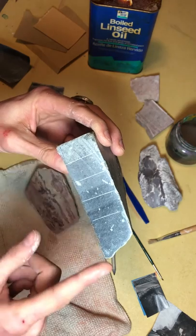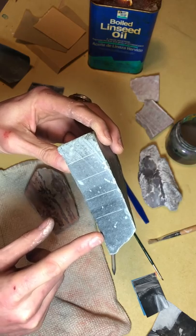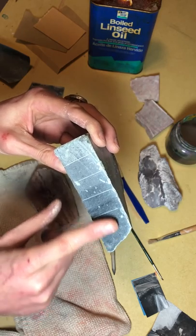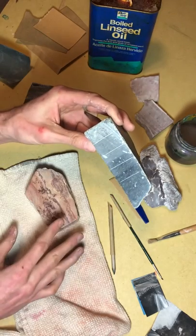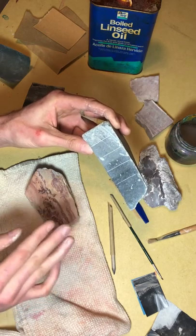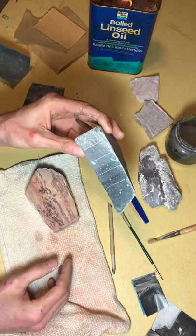From 800 onward on the sample board you can see the improvement. I ran out of sanding paper partway so I had to add more, but I really want to get to 1000 in this last section so you can see what it looks like when you take it to the next level and polish it up. My next step will be to let this dry completely until it no longer looks wet, then apply oil and do wet oil polishing with 1000 grit. I'll show you what that looks like in the next video.